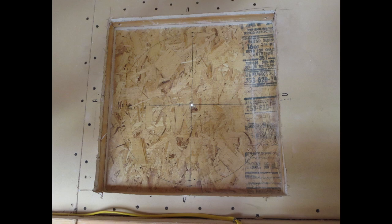From the inside I cut out the sheetrock attached to the outside of the wall to reveal the siding. A multi-tool came in really handy for this. I marked the center of the opening, drew a circle to represent what I'd have to cut out, and drilled a hole through to the outside. I'll be cutting out the circle from the outside — there's not enough room on the inside to maneuver the jigsaw.